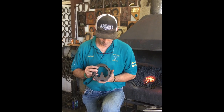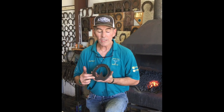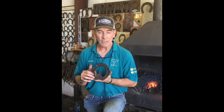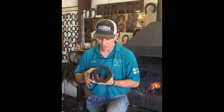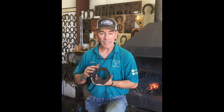We finished it up. This shoe came a little bit bigger than the specimen, and so a lot goes into that mark right there. I marked for my frog plate 1¾". Well, you could bump it up a little bit to 1⅞", maybe 2 inches, but it changes drastically because 1/8 inch is a 1/4 inch difference in the branch length. So I came just a skosh big on my length and width.